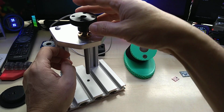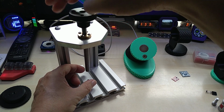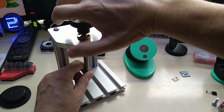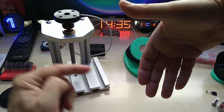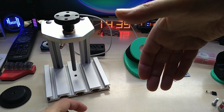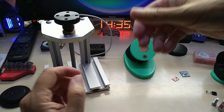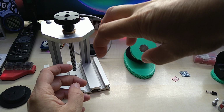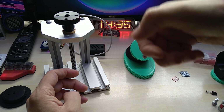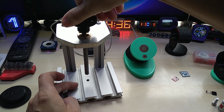Now, I'm not sure if I'm going to be able to torque this to put a glass into the watch case, but I think it will work. Worst case, I have holes here, so I can put something on here or make this bigger and then torque it. I have seen the presses that have a lever like that and then you press like that, but with those I don't think you have smooth leverage. I've seen on YouTube videos where people put the glass in and they press and then plop, it slams into the case. I wanted to have, how you call it, a smooth movement while going in, not just pressing it in with one shot. And this way you will have much more feeling when you're pushing it down.